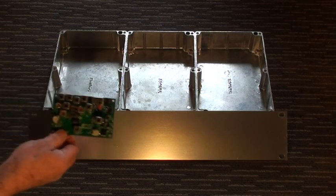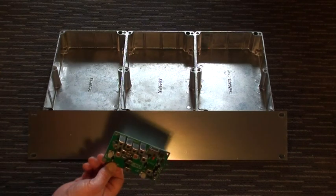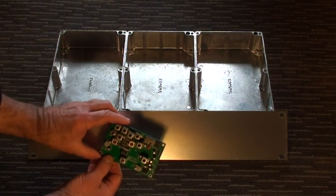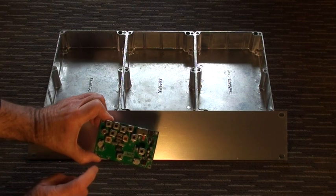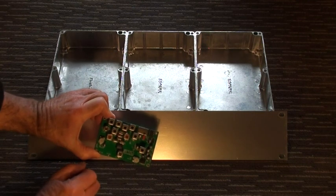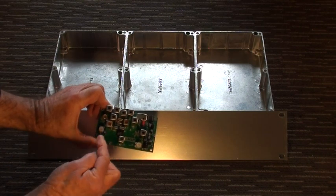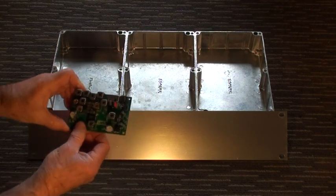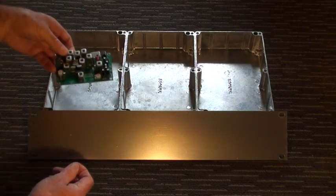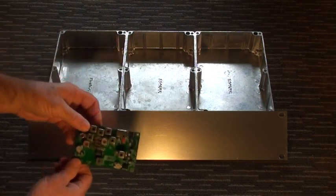This is the Hamtronics receiver board, very high quality FM receiver. This is the later one they've produced, which has the onboard squelch and volume controls. The previous one had some large pots mounted on the front and you could simply mount them through 2 holes drilled and you could control it from the front.